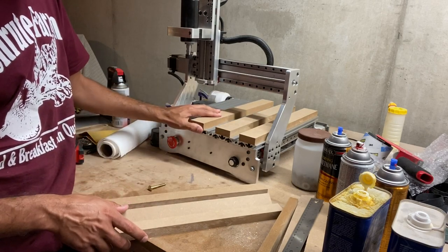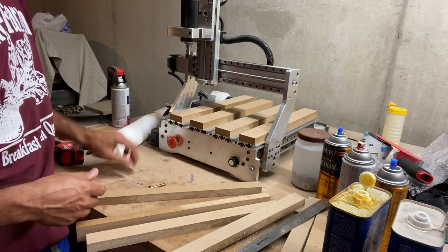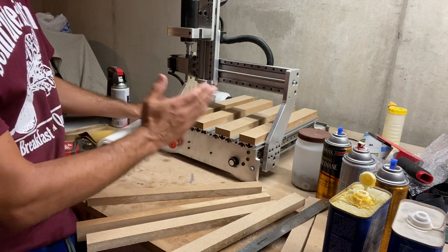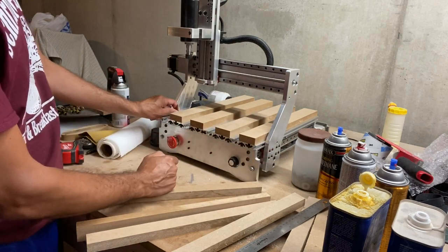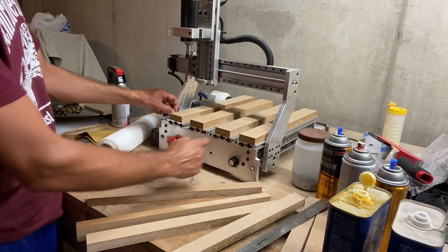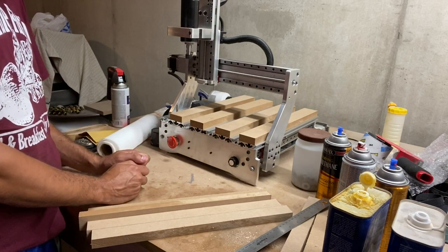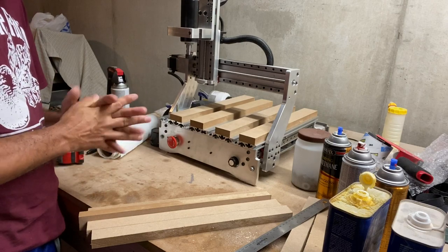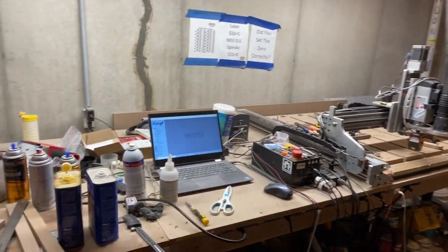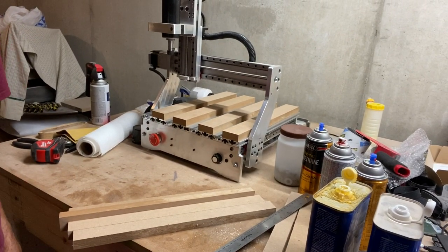I'm probably going to stay with the two inch though. If you buy one of these machines, do what you think is best, but I think two inch is going to give me the best spacing. I wish it was an odd number of slots because I would have clearance on the other side for t-bolts. You can always clamp down material — you just have to know that you're limited on the size of the bed. As long as you know that when you buy a machine this size, you have to prepare yourself for much smaller cuts compared to a larger machine.